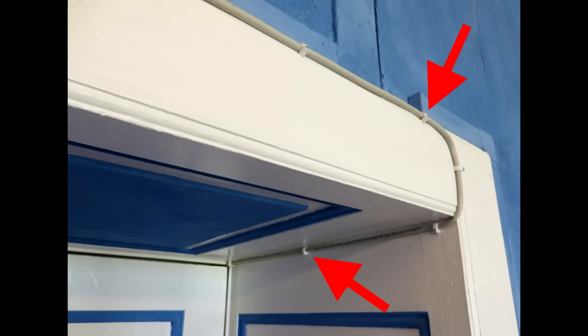So the question is: how do you actually route Ethernet cables nicely? In this picture you can see the top of a door frame. The Ethernet cable is actually going through the upper right corner of the door. In this particular instance, there was enough of a gap at the top of the door where I could run the Ethernet cable through, and when I open and close the door, it's not going to rub on the cable at all. Then it was just a matter of using little cable tack things — little plastic clips with nails — and you run the cable along the door, across the top of the door frame, down the left side, and then around the perimeter of the room, coiled up under a bed.